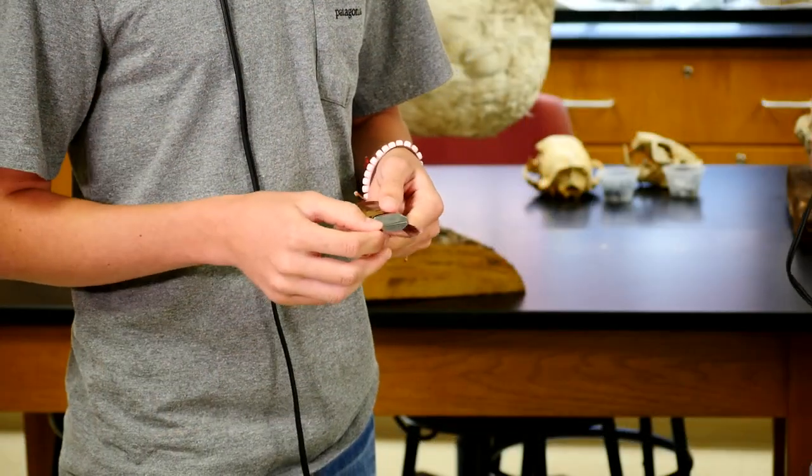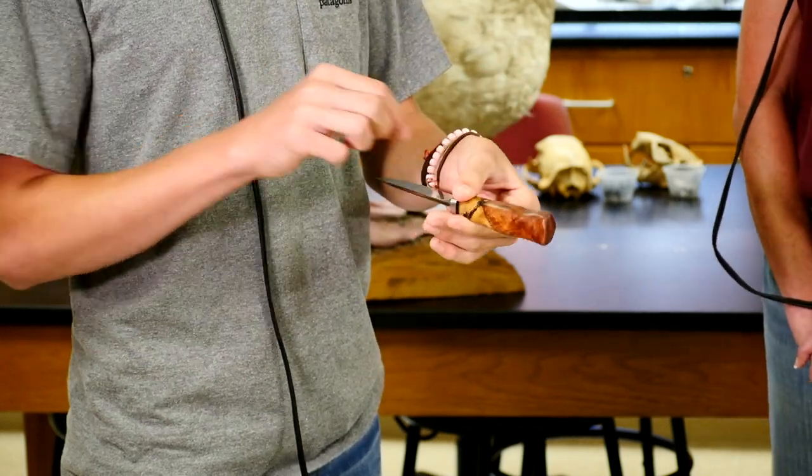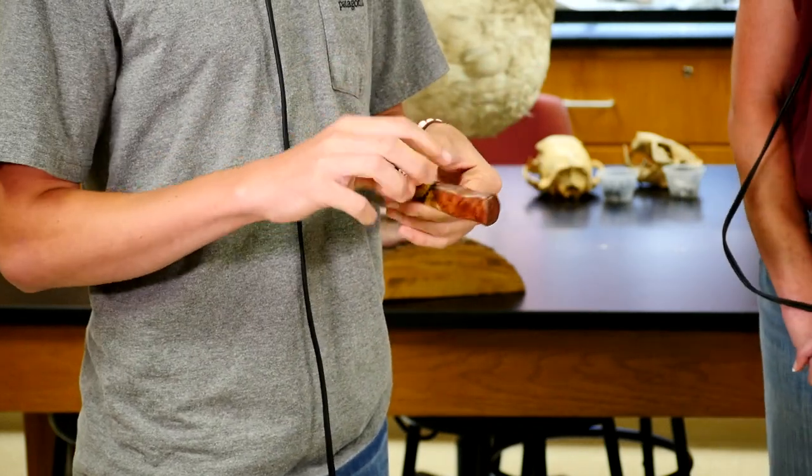Yeah. So after that, we take it to what's like a golden brown color, and that softens it, but it doesn't soften it to the point where it's not hard anymore, but it makes it where it won't just break on impact. It'll flex and bend. After that, we go into hand sanding, which is the part that makes every knife maker just want to kill themselves, really, because you sit there for up to hours on a knife with sandpaper just rubbing out every scratch you've had.